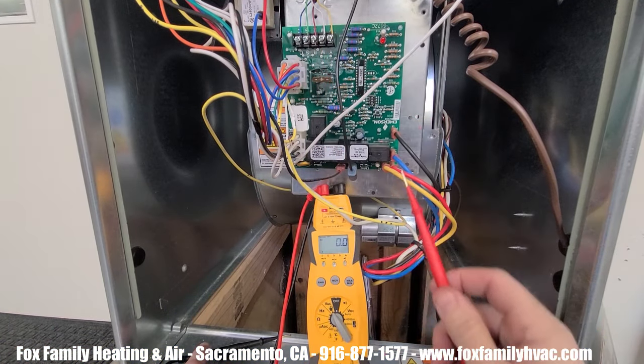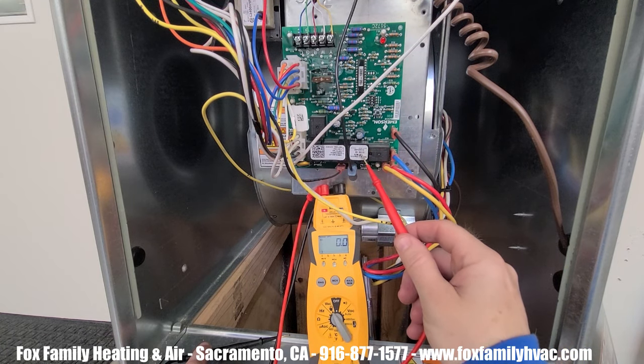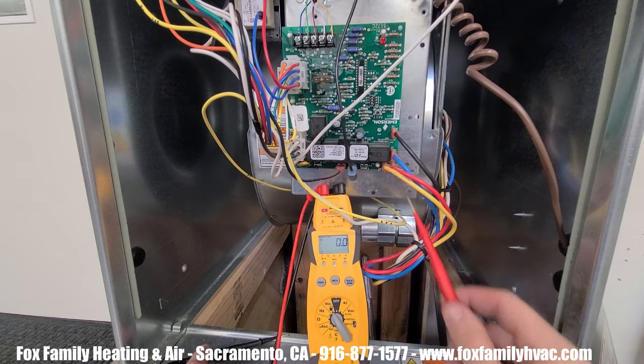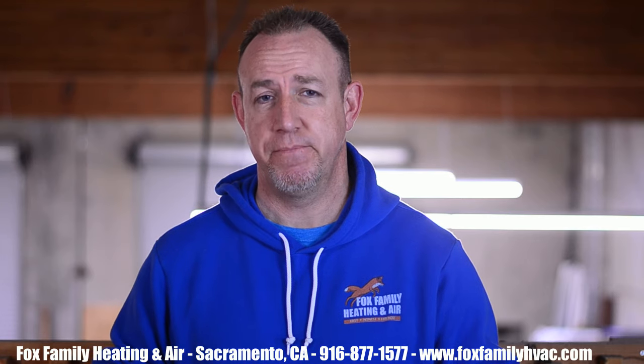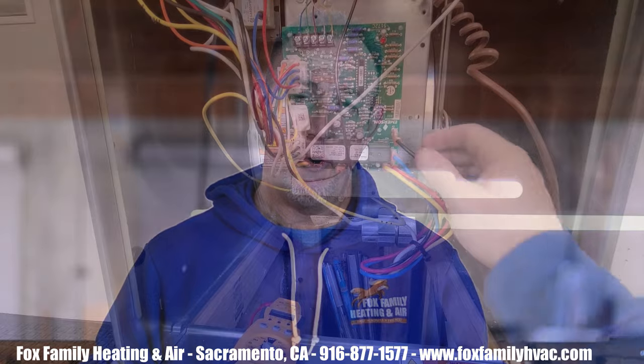Once the low voltage signals have made it to the control board terminals, a series of connections wind themselves through the printed circuit board where a switch will energize to send 120 volts, or in some cases 240 volts, onto the blower motor. Check your wiring diagram to be sure which motor you have. Here are 8 things that you can do to diagnose a bad furnace blower motor.